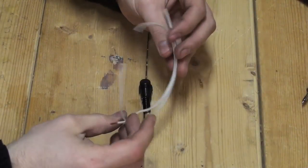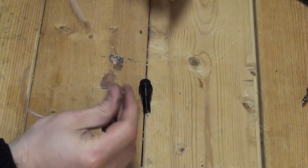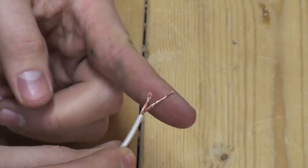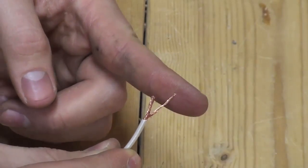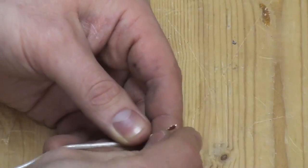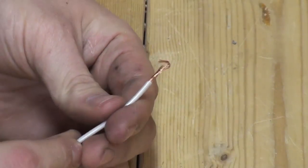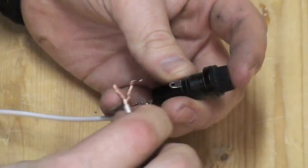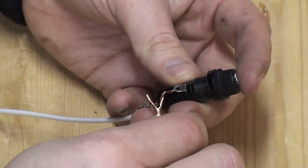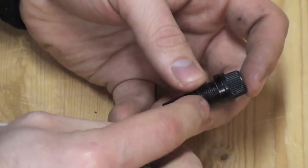Wires will need to be attached to each of the terminals and attached as noted in the diagram. Depending on your fuse holder, the 14 gauge connection wire may be larger than the holes in the terminal. Separate the lead and shorten one length of wire. This allows for the longer lead to pass through the terminal, then wrap around the bulk of the connection wire.